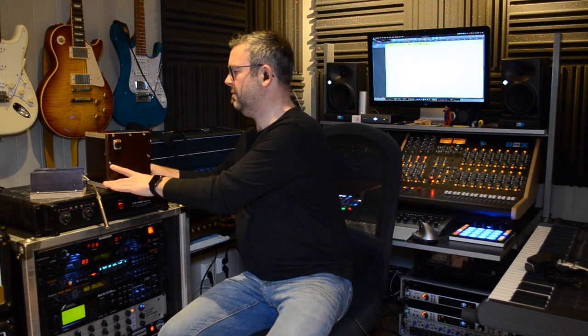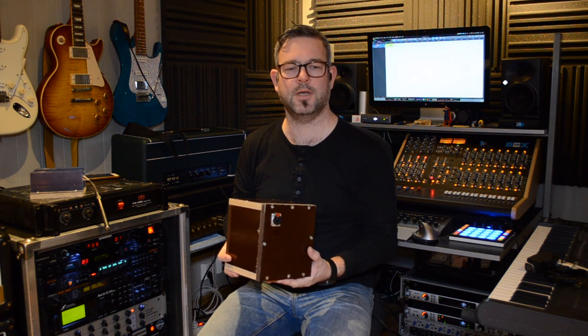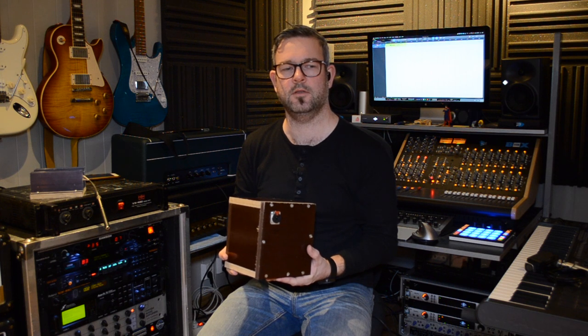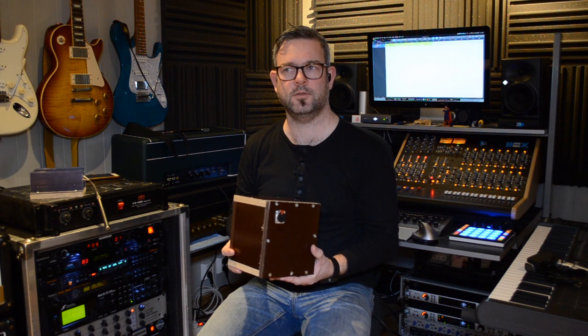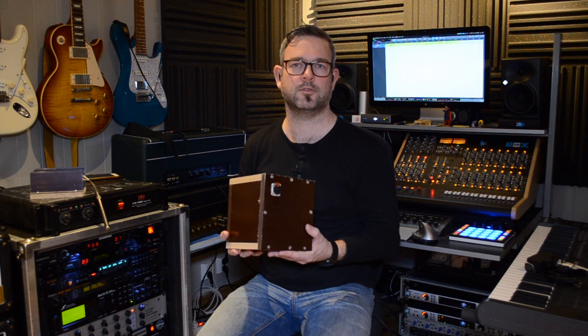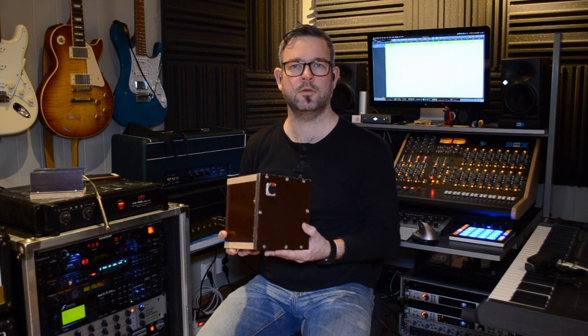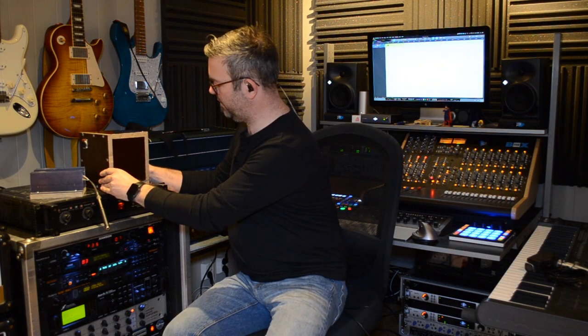And the other one is a self-made, essentially a speaker box with two small speaker engines inside. It's two coils and magnets with 16 ohms, and they can handle 100 watt each, so it's a 200 watt load box, reactive load box. It acts just like a speaker would do. So that's gonna be fun. See if you can figure out what's what.